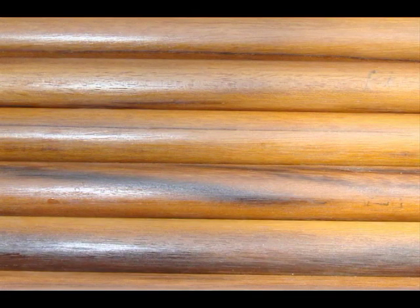Now I want to point out what people commonly refer to as cracks in poles. You see the top three — they have the dark hairlines running lengthwise on the pole. These aren't considered cracks by the manufacturer mainly for two reasons. First, they're not open, and they usually put putty over them to make sure air can't get in to widen them. As long as they run lengthwise they really don't affect the pole's performance at all — it doesn't cause the pole to crack or break. It's only if they go horizontally or widthwise that a pole will snap. That's one of the reasons they test the pole by banging it to make sure it's not going to crack. So if you get something like this, your pole should be fine and they consider it normal.